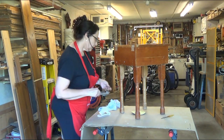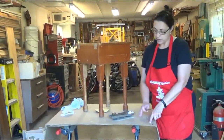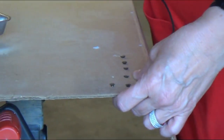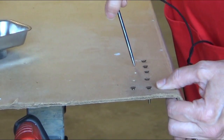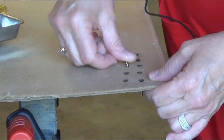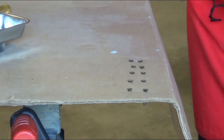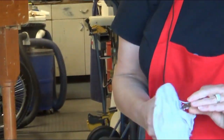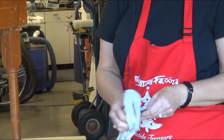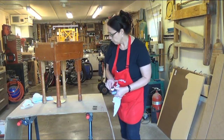I'm going to take these over here and zoom in so you can see what I'm doing, because I have my table set up on a piece of cardboard to catch the overspray of the spray paint. I want to paint my screw heads so I'm just taking an awl and poking some holes in the cardboard for the screws, and I'm going to put my screws down into this cardboard so I can spray paint them black. I'm going to wipe down my hinges — you just want to kind of remove the dirt and grime off of them. Now if you're painting with chalky paint you can paint these hinges with some DecoArt multi-surface paint — that would work just fine for these.